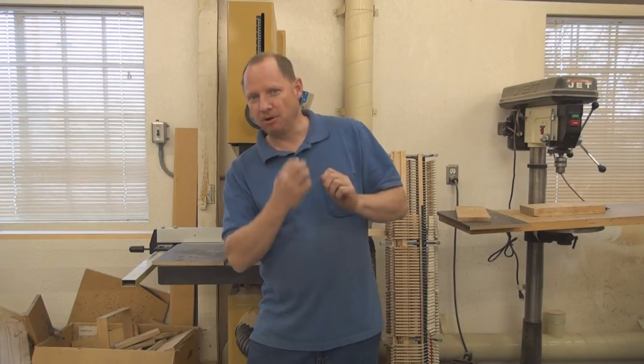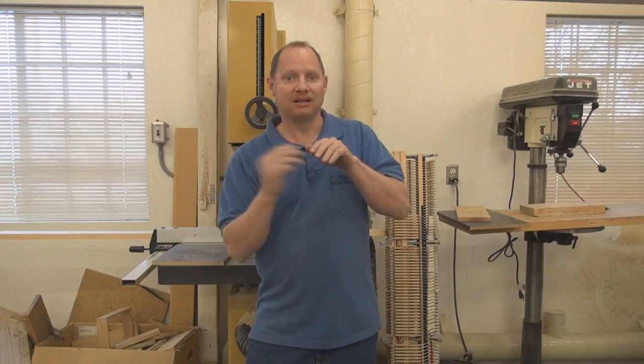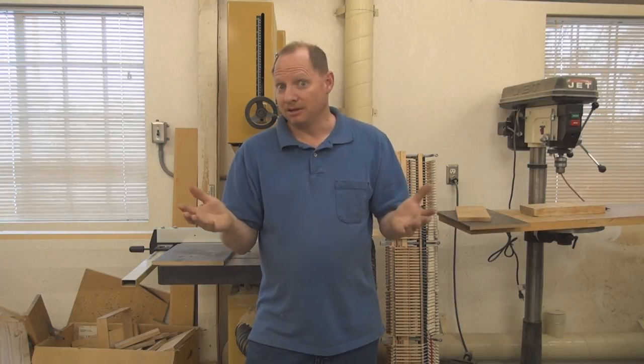Now, why would you need to do this? Because when you put shims in, a little bit of that shim is going to be poking out from the bottom. Now you're going to have to go under there and trim that, sand a little bit, or at the very least there might be some kind of glue line or something in there that you're going to have to clean up. What does that mean? You're going to sand away some of the old finish that's still on the bottom.